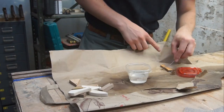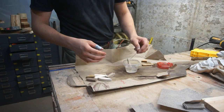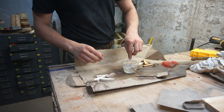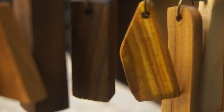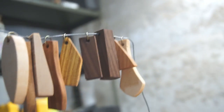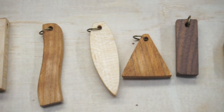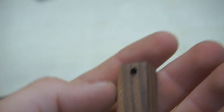They weren't the worst, but not the best I've made. I definitely learned quite a bit. Simple shapes are definitely the easiest — squares, rectangles, those sorts of shapes — and they end up looking better because they're so simple. The maple I used didn't have much figure, so next round I should pair it with a darker or more figured wood. I also learned that having the holes for the jump rings centered makes them look a whole lot better. Each and every little thing you do to all of them increases the value of each one individually. In the future, I will do shapes without curves, because of all the time it takes to sand them. And if I do want to make curves, I'll make sure they're only along one axis — multi-axis curves are just way too complex for me to sand right now.